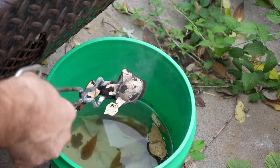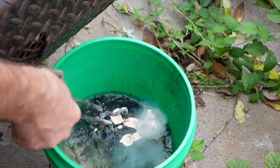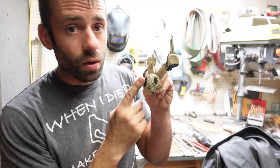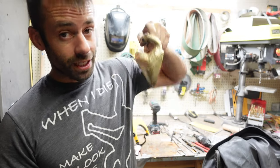When there's a clump of sand on the metal and you try to quench it, it can explode when the water hits the metal — it's like a popcorn kernel going off. If it's big, it can be big and scary. None of my keys turned out, but I got a cool shark tooth that worked, and that's why I do that. Available on Etsy.